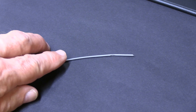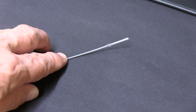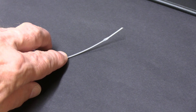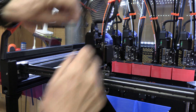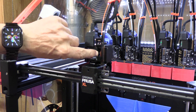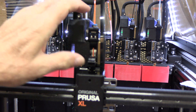So I took a close look at the filament. Do you see that area that was ground out? I thought I don't have enough pressure on the feed roller, so I need to increase the pressure on this area. I want to put more pressure on these idler wheels that are pushing against the filament, which is in here.